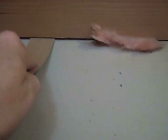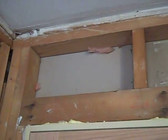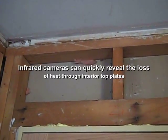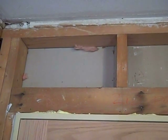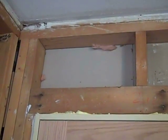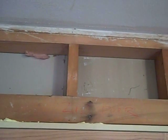Someone wants to know: why do these gaps get put there? If drywall was put up against the stud during construction, why is there now a gap? The reason is that lumber always dries out and shrinks. Depending on when and where your home was built, this was a bigger problem during certain eras than others. The quality of lumber and construction is always suspect and depends on your builder. We have seen brand new homes only a year or so old that already have these gaps at almost every top plate, creating a huge loss of energy up into the attic space.